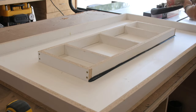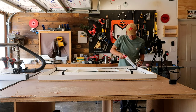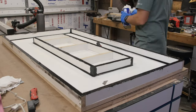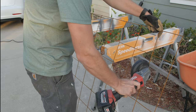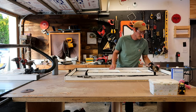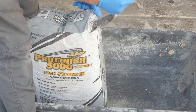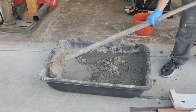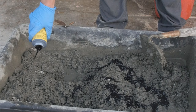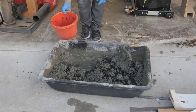I have some other videos on how I've done concrete tops before, like my custom concrete sink, so I'll leave links to those. Basically, you're just making a two-inch thick form and putting some wire mesh inside of it. The concrete mix I'm using is the Quikrete Pro Finish 5000 — I need about a bag and a half for the top. I also want it to look like a dark charcoal, so I'm using two bottles of the Quikrete charcoal dye to darken it up. You can grab all this stuff at Lowe's or Home Depot.